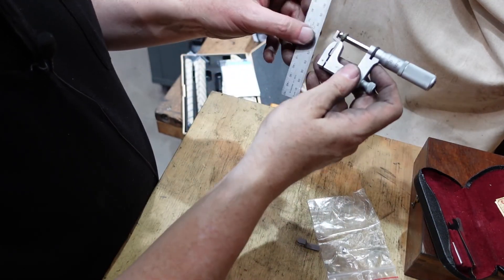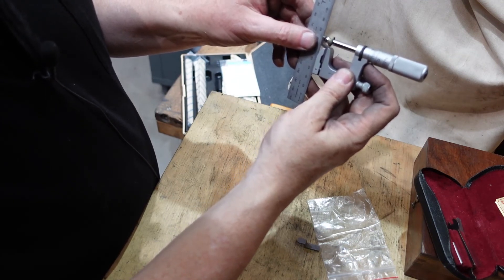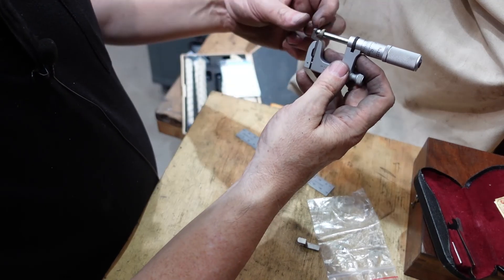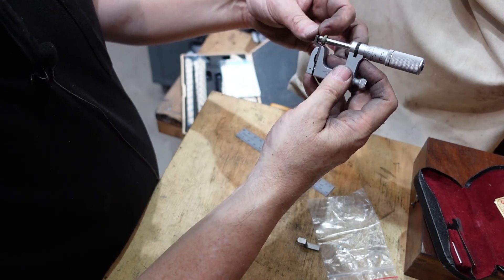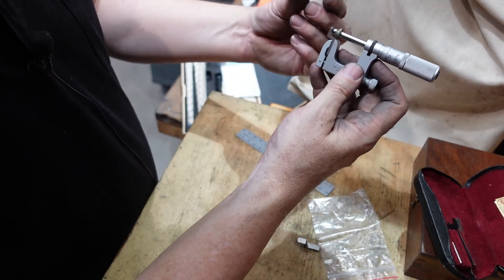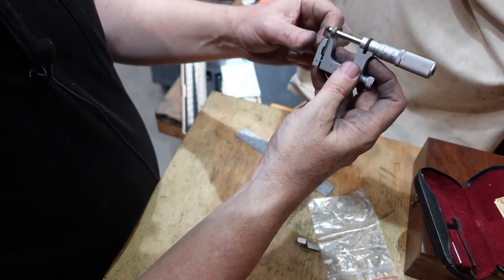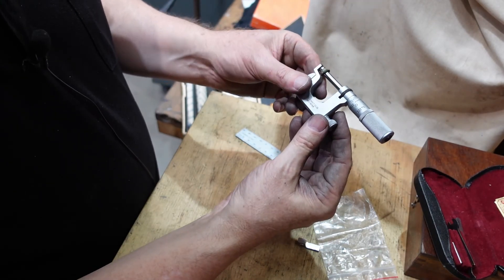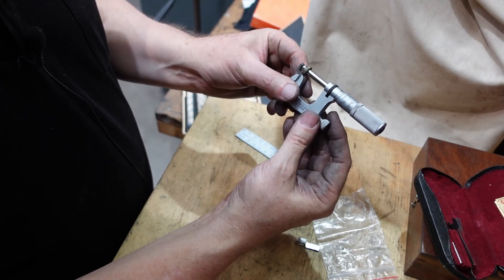The nice thing here is that the back of that anvil is the deepest part, and that's only about 2.4 millimeters thick, which means that if I've got something like on the chuck of a lathe that I want to measure, I can actually squeak that in there and measure it. Previously with a standard micrometer you've got something like six to eight millimeters of anvil plus bow to measure around. So I think this is a great thing - but time will tell. Thanks for watching, hope this is of a bit of interest and inspires people to make their own bits and pieces.